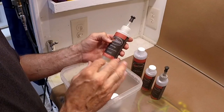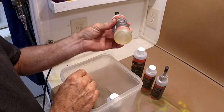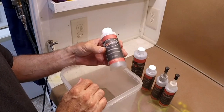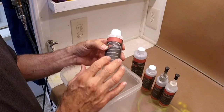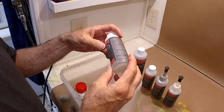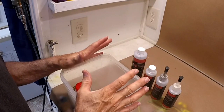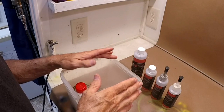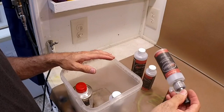Silver is absolutely unforgiving — you have to have the exact kind of material to put on it. They send you what's called a mid-clear, which is essentially a one-part clear coat that you can thin to spray. Then the last thing you do is apply a top coat after you paint it, or if you leave it just chrome you can apply it directly — it goes on over the mid-coat and you apply it with a spray gun, thinned pretty heavily. The drawbacks are that it's difficult to clean up. You've got to be prepared with decent spray guns, and you really can't use the airbrush for anything other than the actual spray chrome finish.